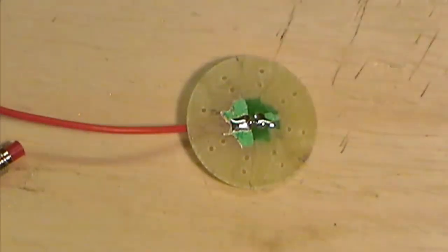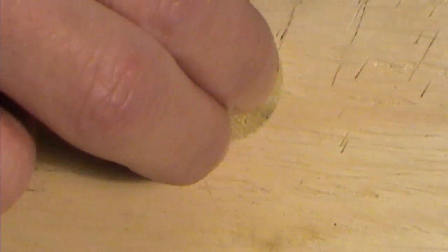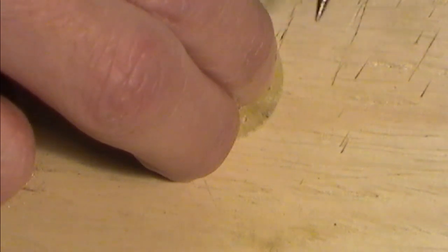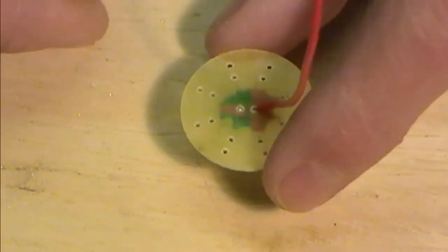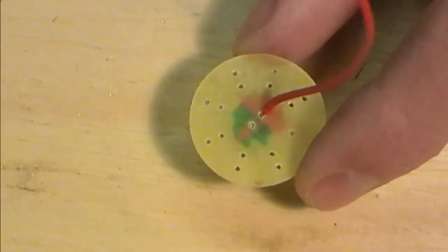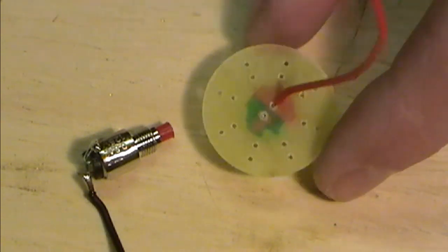And then I'm going to bring in my spring that we had earlier. I'm just going to pop that down central over there. So I'm going to have to get my hands in the way while I'm doing this. And just solder that spring back on top of the wire there. So now when this disc pops in, face down like so, I've got my connection coming off there to my pos wire, which is going to be permanent, or neg, it doesn't really matter which way you put the battery around in this, and my switch there is going to be carrying the current up through the body.